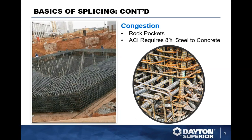And what you're looking at here is a standard rebar cage, typically in a column network, coming up. And what happens here is, how do you get concrete with the aggregate and right into all those little nooks and crannies and everything in there? A lot of times what happens is you end up with rock pockets, but no liquid material in there to help fill any of those minute voids, et cetera.